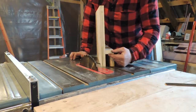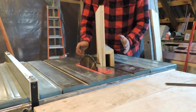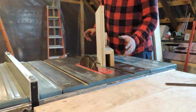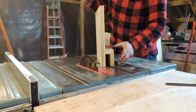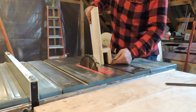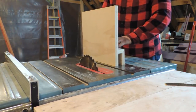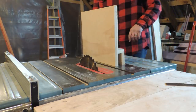What I do when I make these - I'll make it a little high, give it an eighth or a quarter high. Because any time I go to glue or screw something up like this, it never stays where I want it. So I'll screw it up, glue it, let it dry, and then I set my table saw to shave just about half a saw blade off of this to take up any inconsistencies, because right now I should not have any wobbling like that on here. So we're going to hit that and let's see what happens.